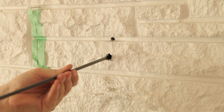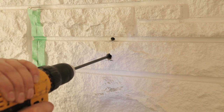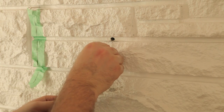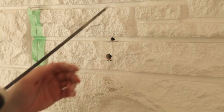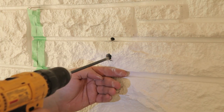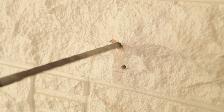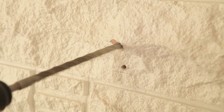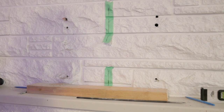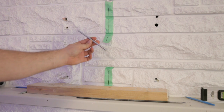It's pretty tough in there so I'm not sure if I'll use the spade bit or not — I don't want it to bind up. After drilling with the quarter inch bit for about an inch or so in depth I started to get concerned, because I knew I was supposed to be in only a half inch of plywood. After carefully measuring with different pens and pencils, I determined that I must have actually hit a stud. I was going to use an anchor to pull the plywood tight to the brick, but if I've hit a stud I can use a different method altogether. I still need to use anchors on the other side, so I used the 3/8 inch masonry bit and started widening that hole as well. I switched to my wood drill bit and found that I hit a stud again on that side too. I measured my hole distance and they happened to be exactly 16 inches apart on center — so if I hit one stud I'm going to hit both studs. I lucked out: instead of using the expanding anchors I can use more traditional lag bolts.